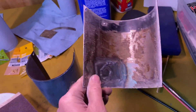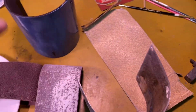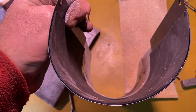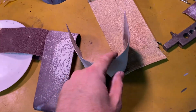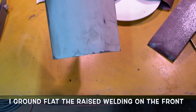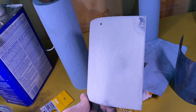This is the original cover for the drum switch and this is a replacement I made. I put a coat of paint on it and messed it up because I was fooling with it before the enamel was dry. The problem is I wasn't able to get the bend just right — comparing the original to mine, it's just not quite the same shape, and when I put it on the drum I have to fight with it a bit. So I'm still interested in making the old one look good — I've tried putting on a layer of Bondo for the patch over that hole, and I think I can build up that indent nicely.